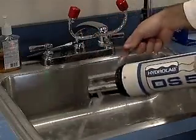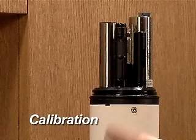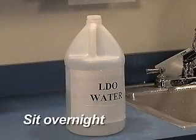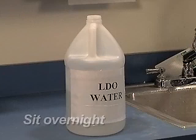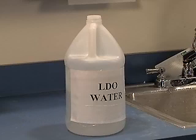When the sensors are clean, the LDO is ready to calibrate. The LDO sensor compensates for the temperature of the water. To perform an accurate calibration, it is important that the temperature of the water remain constant during the procedure. The easiest way to do this is to allow the water used for calibration to sit overnight in an open container until it equilibrates to room temperature. If the temperature changes by more than 0.5 degrees Centigrade during calibration, dissolved oxygen measurements may be inaccurate and the sensor will need to be recalibrated when the temperature stabilizes.